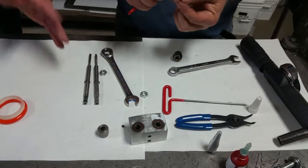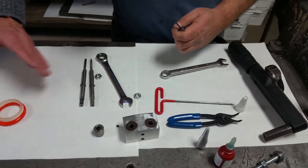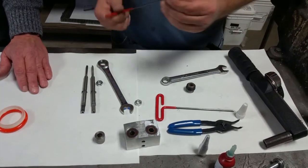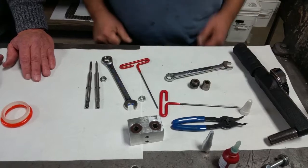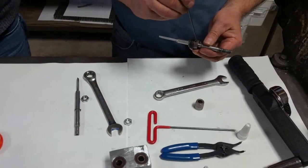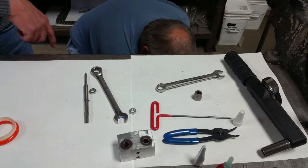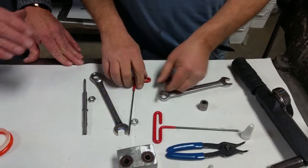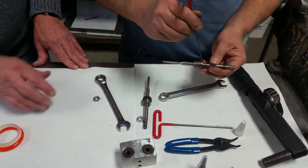Now we're always going to try to put new set screws in there. The set screws cost probably a nickel a piece. Think about the mechanic that's going to follow you out there and he's going to have to dig all the stuff out — and if one of them cracks, you guys know as well as I do, that can be a two-hour job getting that thing out of there. So I always tell everybody just put new set screws in it. Now we're going to get the screwdriver shafts back in there. He's just going to snug it down because we got to adjust it in a minute. Anytime you tighten them set screws up, you want to make sure the set screw is really good on your flat right there. You don't want that pulley coming up and down on you, and under normal circumstances we'd have put a little blue Loctite on that set screw.